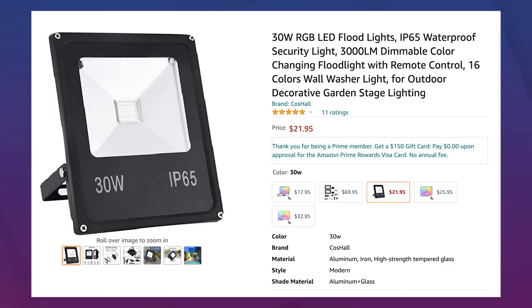Normally I'm just using a basic floodlight from Amazon — it's super cheap and inexpensive to get some awesome colored lights in your background. I've recommended this light on the channel multiple times, but there is an issue with it. The main issue comes when I switch colors — you can see the absolutely insane banding and flickering going on, with black bars going up the screen. This is a major issue when shooting with lights not meant for making videos. There's a miscommunication between the camera's shutter speed and the frequency of the light — they're not syncing up, causing terrible flickering and banding.